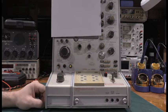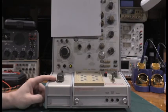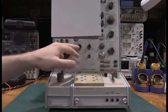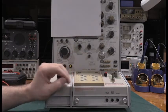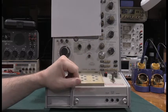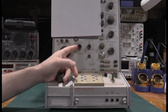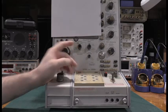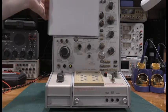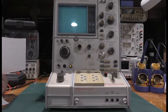Variable collector supply — I still need to clean this. I'll do that on camera. I have to flip the unit sideways and get at this from the bottom. It's cleaning up real nice. Some of the controls are cracked; I'm not sure how long they're going to last. It originally didn't have a collector supply knob — I got a new knob for that. This one is cracked pretty badly, so I'll keep an eye out for a new polarity knob. That's where we're at after the first cleaning — it's looking pretty good. Got a little bit more to clean up, and then once the alcohol flashes off, we'll fire it up, do some power supply tests, and hopefully go through an alignment.